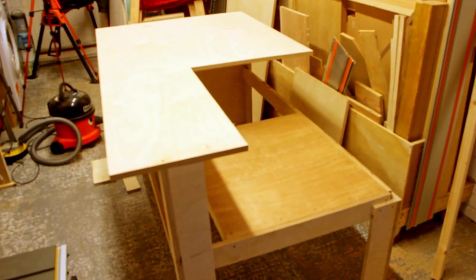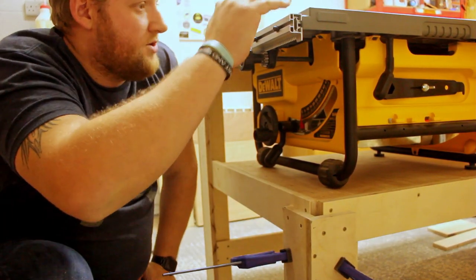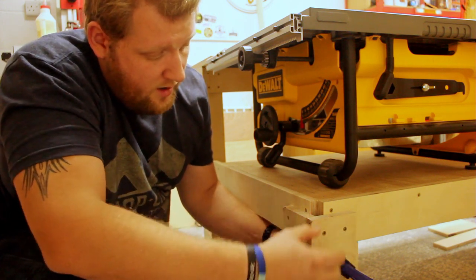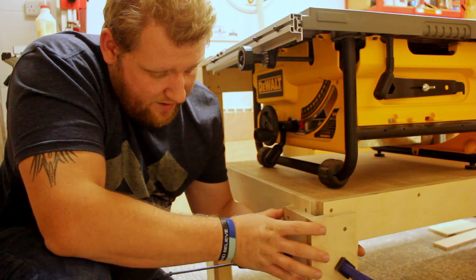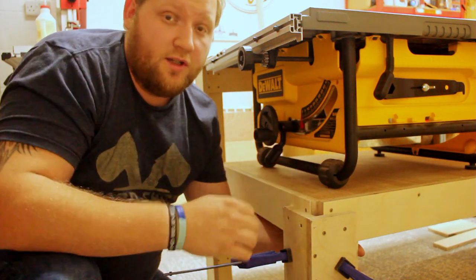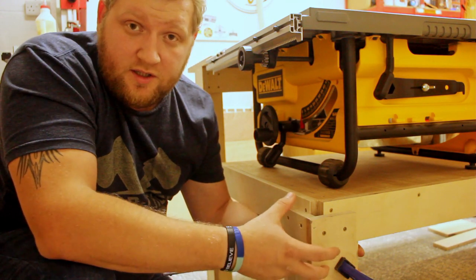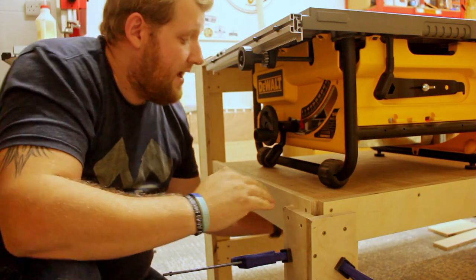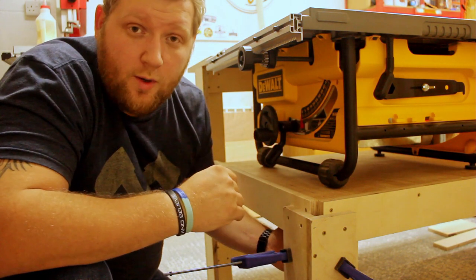So I've got it upright — let me show you the other end. That is where the table saw is going to go. I've still got a lot to do. The plan here is to drop this corner a little bit. I've taken the screws off from inside, and I've got four screws holding on here still and clamps clamping a little angle block. I actually cut off the top of one of these into place, which means when I undo those screws this won't suddenly drop — I can control the angle of drop just by loosening and tightening the clamps, hopefully to drop this corner down a little bit so I can level it and get the opposite corner up. Whether it will work or not, we'll soon see.